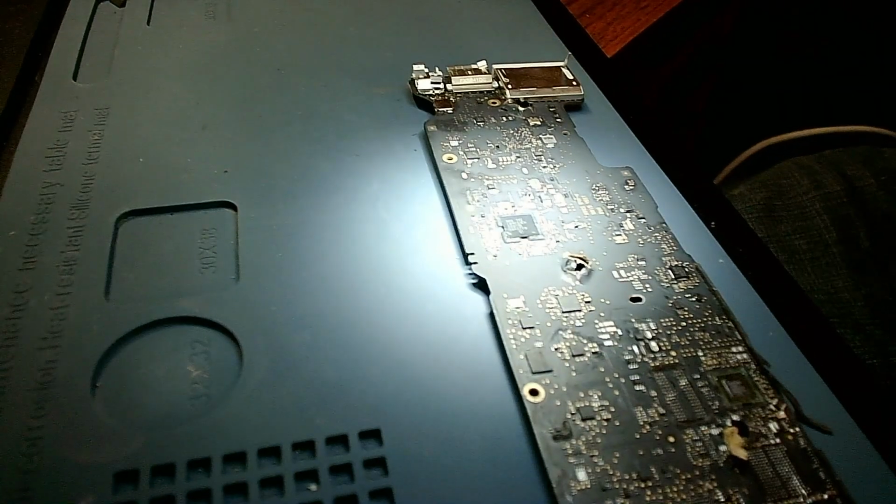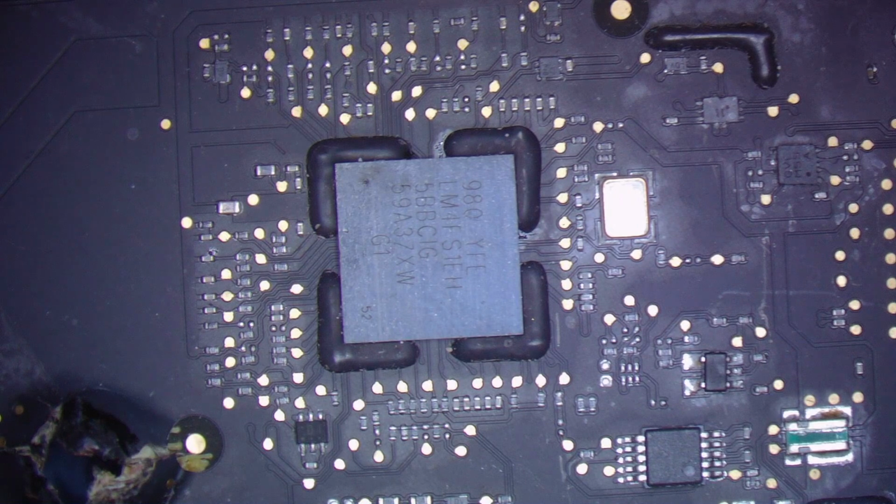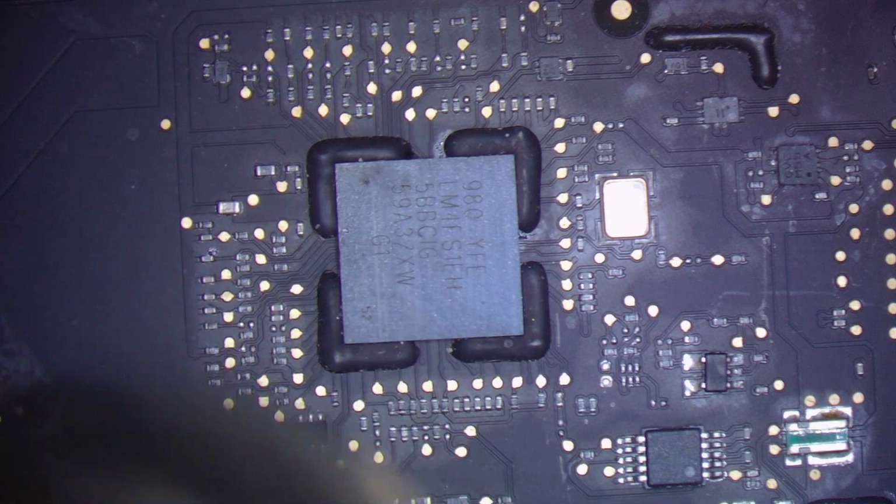All right, now to remove the SMC from the donor. Switch you guys back to the scope only. There we go. All right, so first thing I'm going to do is switch out my head here. I guess I could do this with the big head too. I'm going to remove the plastic, but I use a much lower heat for that. And again, same kind of process, just heating the top general area of the board, a little less careful because I don't care about the donor, but I do care about the SMC.